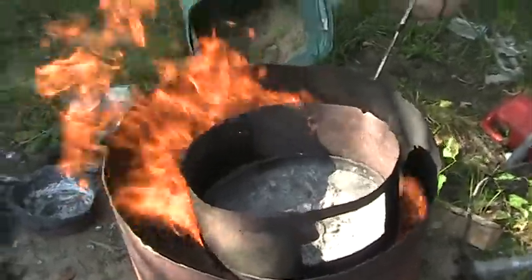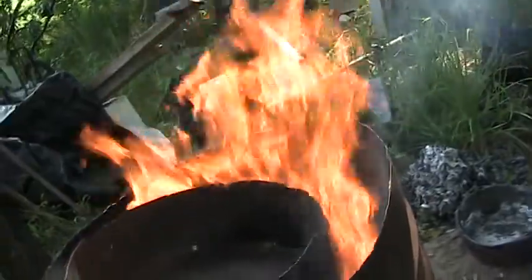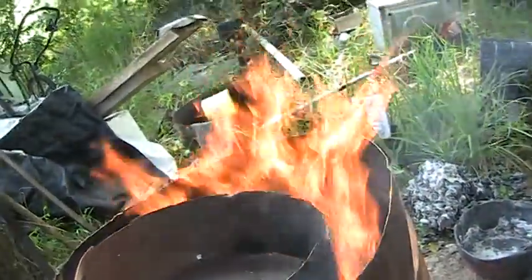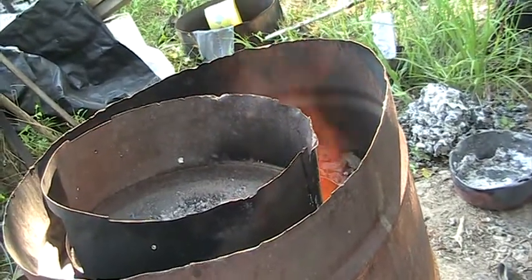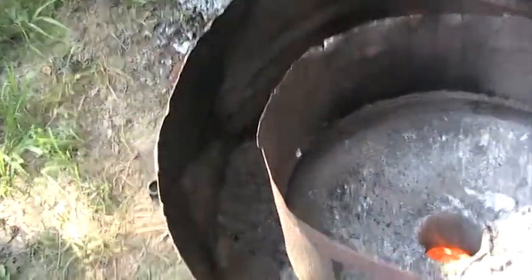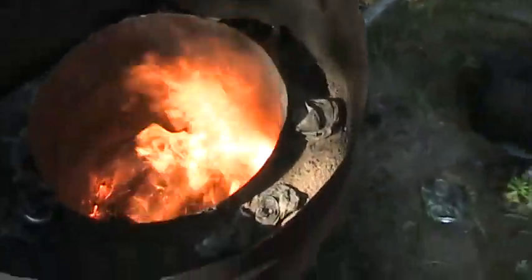As you can see, we're starting to get up to temperature now. I'm gonna back my oil off just a little bit. There's a little bit of delay, so you gotta find your sweet spot. Show you inside. Now you see how it's trying to swirl a little bit? It'll swirl a lot better once I get my pan in there. You see that sprocket starting to turn red hot where that oil falls on it? That's good. All right, let me put my smelting pot in.